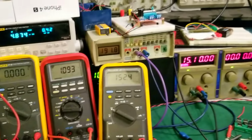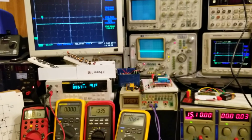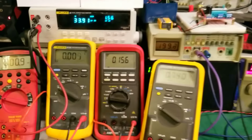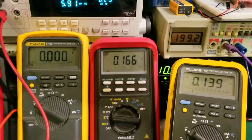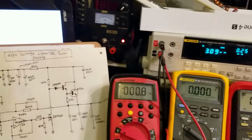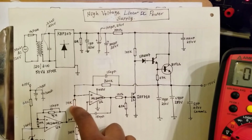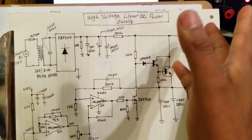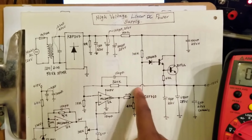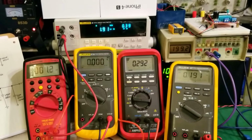So this is the demo. What we'll do is see if we can put everything in one shot. Well, this is wiring. You can see now at the low end of the scale, below 1 volt, the circuit is a little unstable. The reason is that the feedback voltage needs to be divided down to something really small below 1 volt, so it's not going to be that stable. But who cares, right? We'd use this at high voltage, so it shouldn't matter. But even now, it doesn't. Let's just test it at 1 volt and see how it operates.